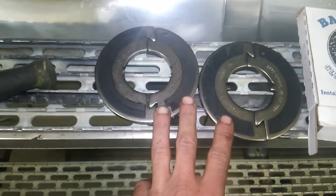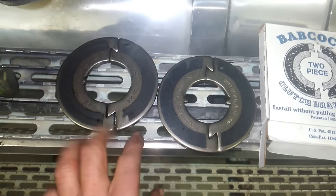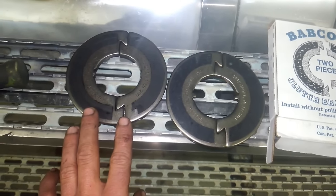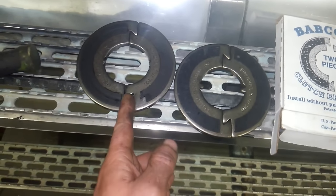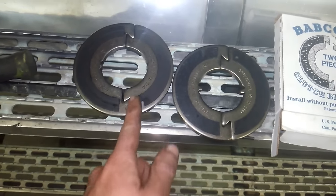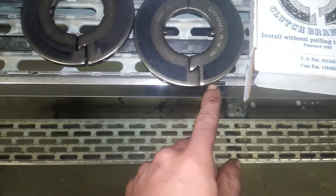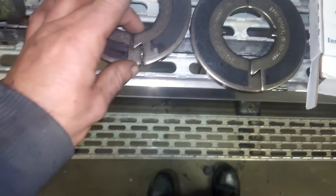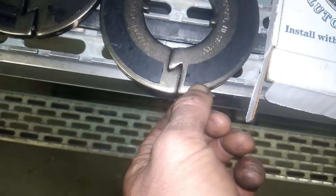These are both two-piece clutch brakes. If you need to remove a one-piece clutch brake — meaning there's no split in it to take it apart — you have to literally cut it off. It's a rather labor-intensive job: you nibble away at it with a torch until you get it down close, then split it the rest of the way using a chisel. With this two-piece style, you can drive the roll pin back out. It has a Z-notch that mechanically holds it, and then there's a roll pin driven in from the side that keeps it located so it doesn't come apart.